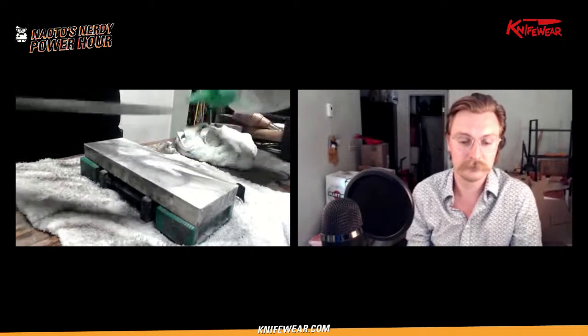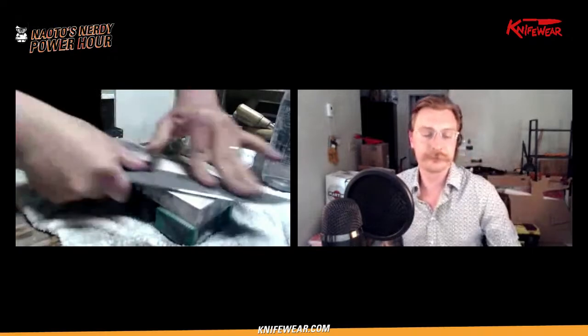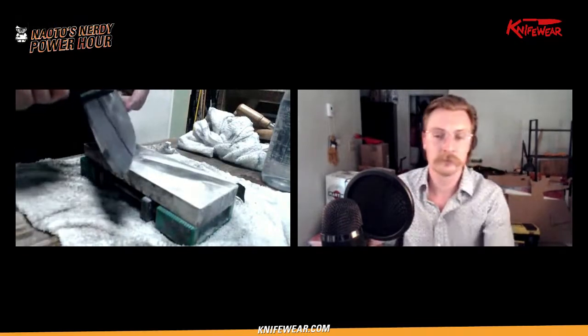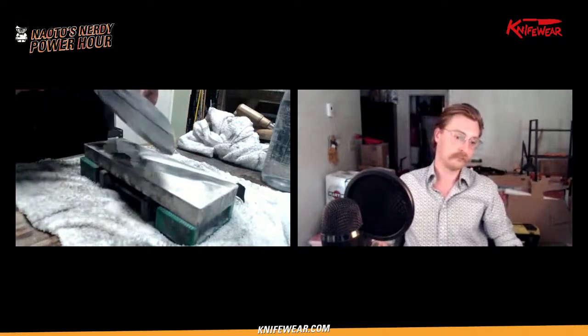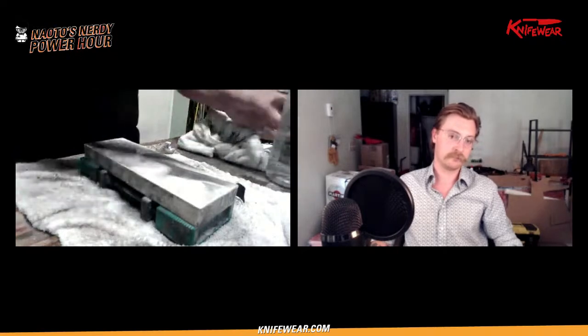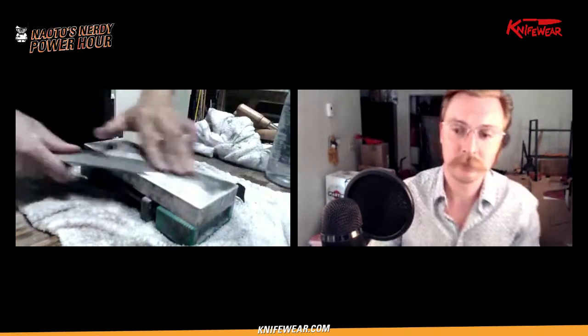And once it's this gone, it looks a little bit straighter, because I was freehanding it, right? But that's my aim, especially for this knife, because it's got such a weird bevel to start with. I just wanted to make it as flat on this part as well as the hira, or the face here. I wanted to make this shinogi as crisp as I could, because it's not as crisp. It had quite a bit of grinding marks on it and stuff.